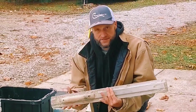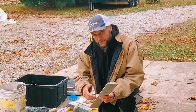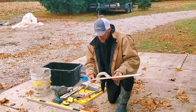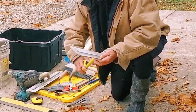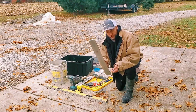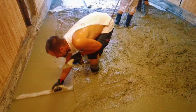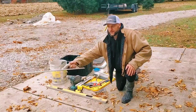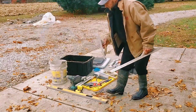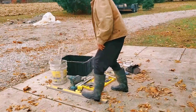This right here is a mag too, but it's called a Darby. We call it a Darby, but when I think of a Darby I think of a wooden-handled Darby that you'd use for cold joints. But this is a 30-inch Darby. I like to float my walls when I'm pouring out with this, and obviously if you want to reach out and touch something, you can reach out and get it. Or you can use your float as a leaner and really reach out there. So that covers floats.